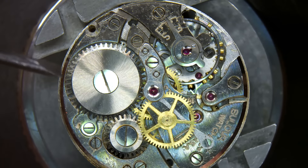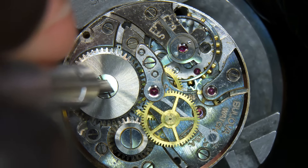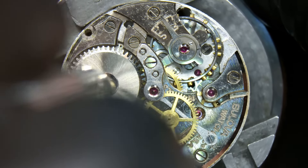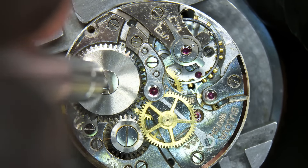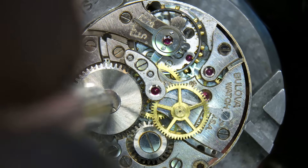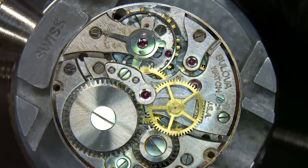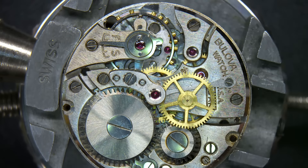I have a problem on my hands straight away — I have an unexploded bomb almost. If I put the screwdriver into the mainspring barrel and try to turn, it's stuck fast. What I'm trying to do is wind the spring so I can move the click to take any power out of the mainspring. That's an indication that the whole movement is pretty much seized up — it's not going to be fun. I'm going to strip down a little bit more, get off what we can and leave on what we can't.